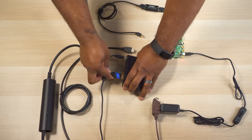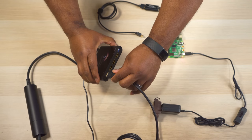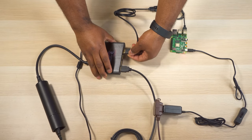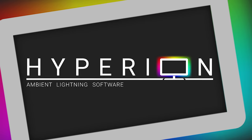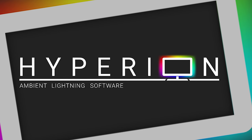So exactly how does this work? We'll use an HDMI splitter to split a video signal to your TV and a Raspberry Pi. Then we'll use an HDMI to USB capture device to capture the video on the Pi. An application called Hyperion will process the video and send a signal to the LEDs. There are a bunch of parts needed for this project — first I'll mention all the required parts, and as I go through the tutorial I'll mention some of the optional parts. I'll put a complete list in the video description.